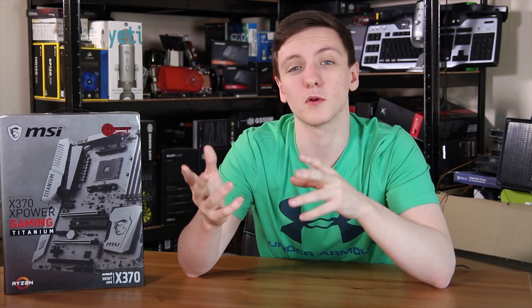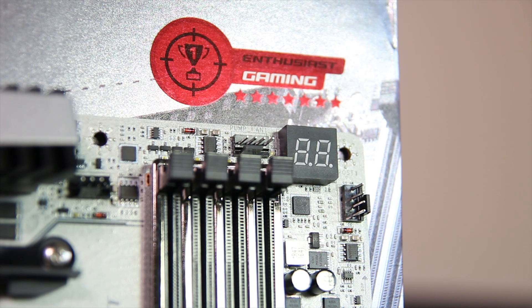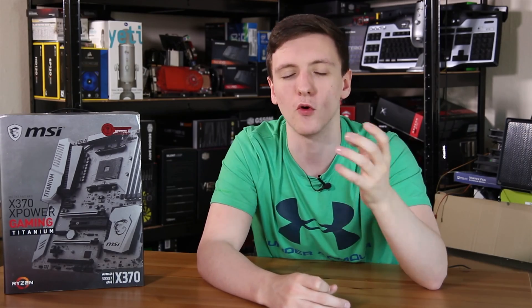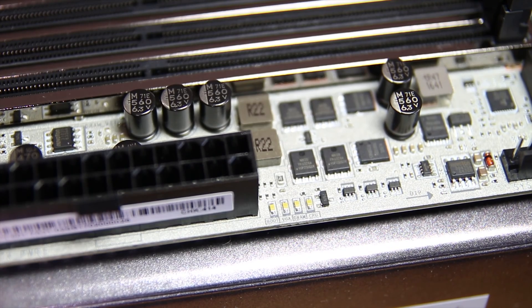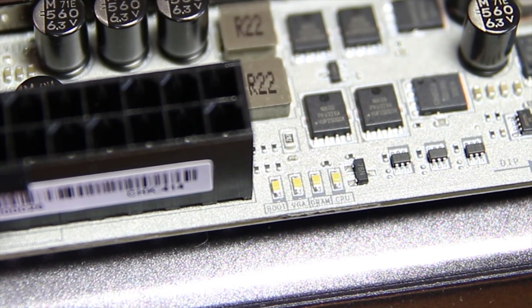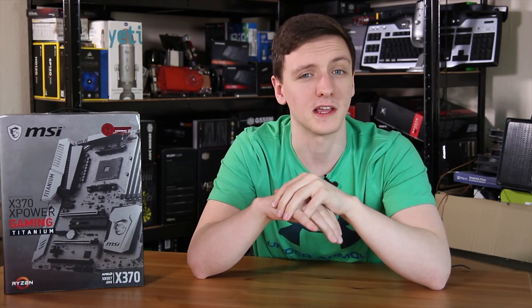On the right-hand side at the top, you also have a debug LED and multiple fan headers — a total of six on this board dotted around, mostly at the top and in the center, with one at the bottom corner as well. On the top right-hand corner you have not only multiple fan headers but also a debug display, which is really useful when overclocking. Just below that, a couple of LEDs allow you to see what stage you're booting through, and especially what issue you're having if the motherboard isn't posting — a very nice combination.